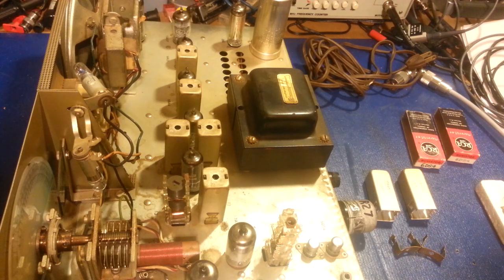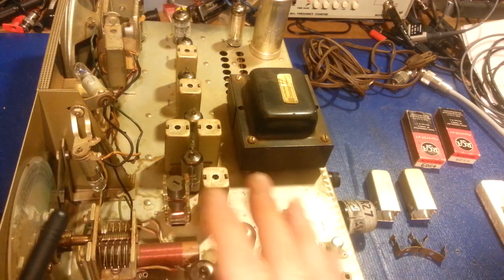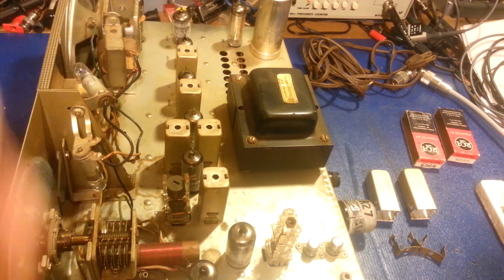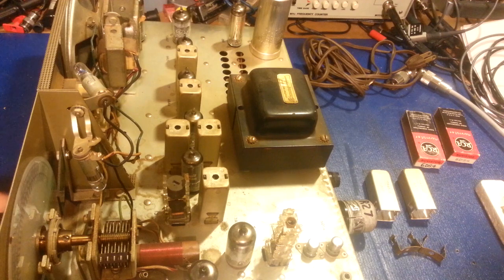The customer had said he could very faintly hear a radio if he keyed another radio close to this one, so that's exactly what I did. I took a walkie-talkie - easy to change channels, no mechanical or electrical connection other than RF energy off the antenna - and tried it on channel 19, held the antenna right here, keyed it, tuned it, nothing. I changed channels, went up to channel 40, tried it, nothing. Came down to channel 1 and BAM - there it was. It's receiving channel 1 on channel 19.